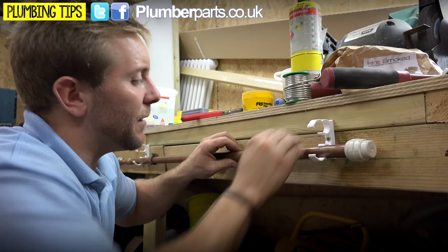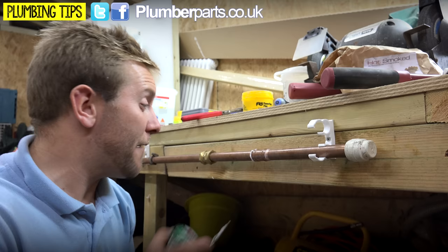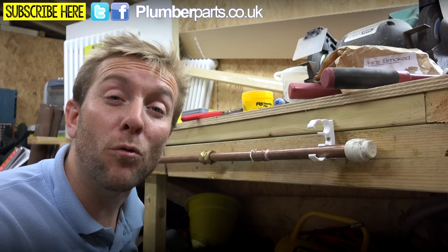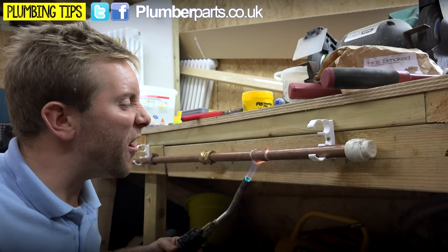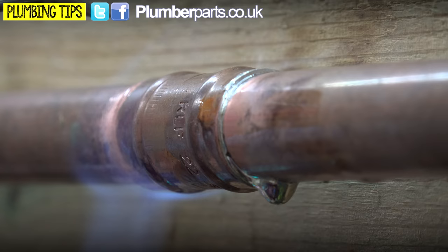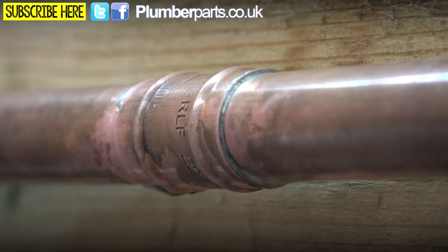They're now recommending that you don't actually use flux on the inside of a fitting for the same reason. Now we're going to get on here and give this a solder up. If you guys out there are trying to fix the pinhole yourself, you're only ever going to attempt this if you are able to solder. We have done a video on how to solder copper fittings — go to our channel, search for it there and you'll find a full guide and full close-ups on how to do it. As you can see, I always like to heat up from the bottom and then run my solder in from the top. The reason I do that is because if it's hot enough for it to run all the way around, it's actually going to run around the whole fitting. This flux is so good for this sort of thing. Give the pipe a clean down — I've burnt the table a bit. Lovely job.